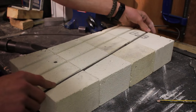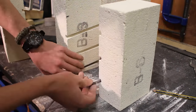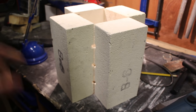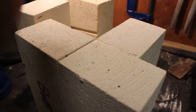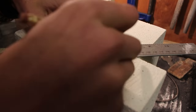Once all the grooves are cut I arrange the bricks back in the order they were cut and put them in the square shape, then start to spiral the coil inside — it fits quite nicely. However, there are gaps on the sides, so I'm going to fix that using another half of a fire brick.